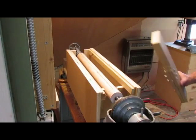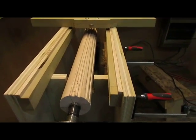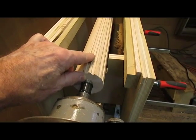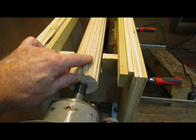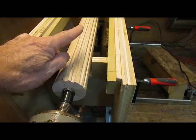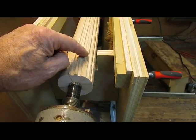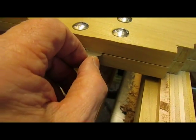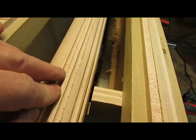You can see the groove is going in there - it's a bit of work but this one seems to be quite straight. The last two came out pretty good. What I did was use a 3/16 inch straight router bit and pre-routed them - I didn't run it all the way to the bottom but nearly there on these two, leaving material for the scratch stock. This scratch stock is a 32nd of an inch wider than 3/16, so it just goes in and cleans it out.